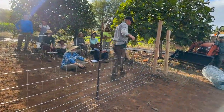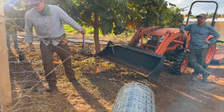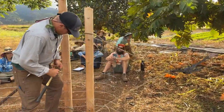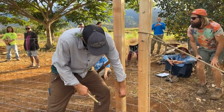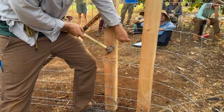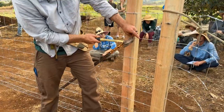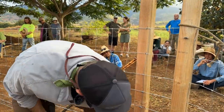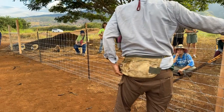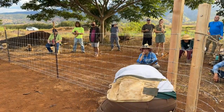So it feels pretty good — we're going to make it tighter. When you start to hear that, now you can attach it. So with your attaching — same thing with your staple, you're going to go back. The fence is going to want to push back this way, so now I'm putting my staple on this side. I always like to clip before I actually take my come along off, just so that it's fully secured. You can in theory take that come along off now and everything is legit, but you actually want to attach this guy, because ultimately you want a lot of the pressure on this post and relieved from this one.